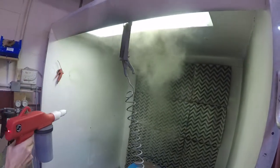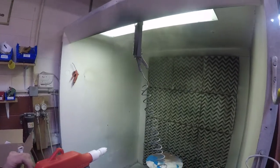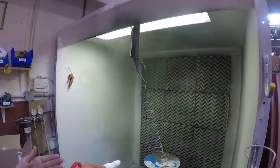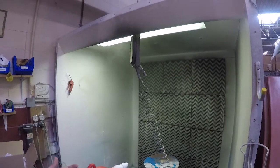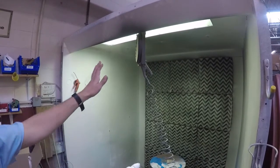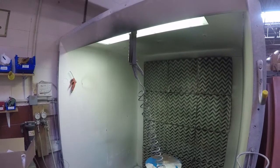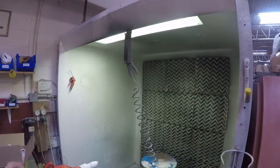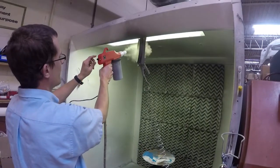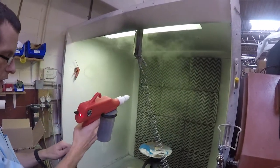You can hear a little bit, there's some charge going on, and that's because this unit allows you to control kVs, but not kVs and microamps independently. And so with a higher end unit, those will offset each other or be adjusted by you to compensate for issues with grounding out or Faraday cage areas a lot more effectively. That being said, for the price point, you can control it by dropping kVs and get into some of your cornered areas pretty effectively.